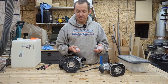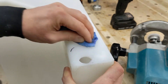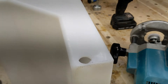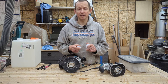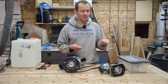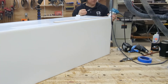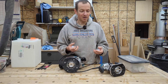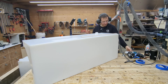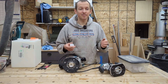There's not many other tips I have to give. I've found that if you've used a Sharpie to mark the location of your fittings, erase that with rubbing alcohol before you start the welding process — otherwise that molten plastic can get dyed or stained, which looks less professional, even though it probably has no structural consequences. Now let me show you that quick footage of me trying to install one of these fittings without the plunge base. The position of the water tank on my bench means I just can't get good stabilization, and it just doesn't go very well. So I choose to use a plunge router — it makes for a very predictable and stable process. Anyways, I hope you guys enjoyed this little quickie. Thanks again for watching.